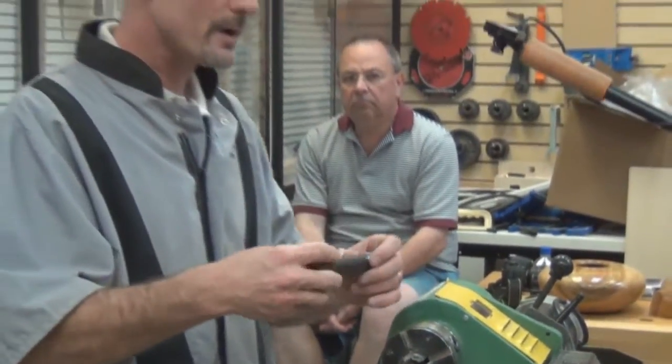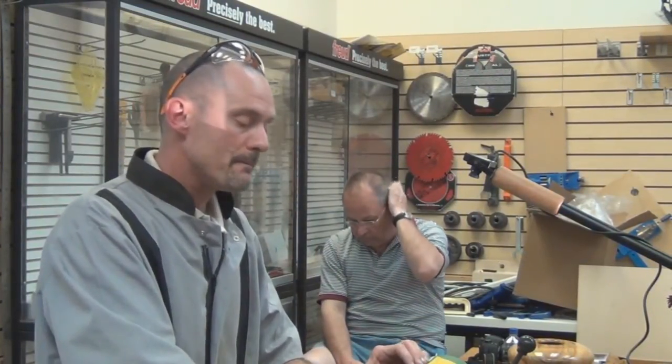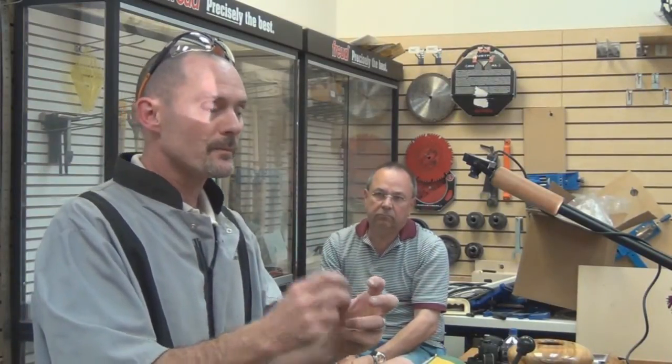And so I decided to go back to the drawing board and start from basics. What I decided to do was to turn and thread the pewter ring first, and then set that aside. And then to turn the finial by more conventional means, in particular the way I was holding it on the lathe. And once I had turned the finial to completion, then glue the pewter ring to it. And the final thing that I would have to worry about, and I figured I'd cross that bridge when I got to it, was how to finish off the bottom of that. So that's what I'm going to do today. Those are the four steps that we'll go through today.